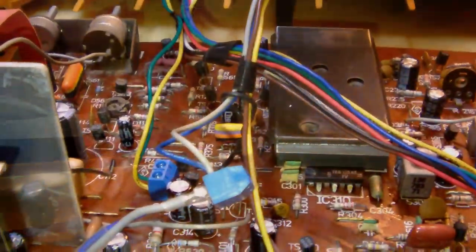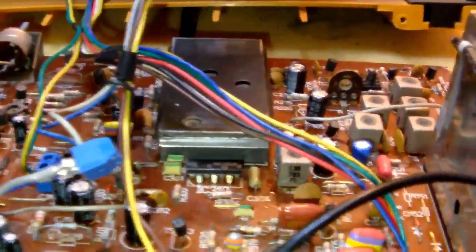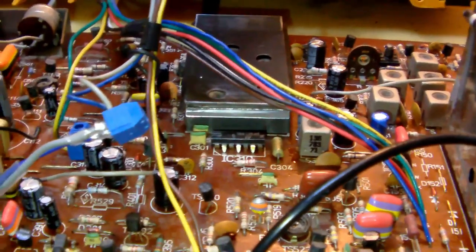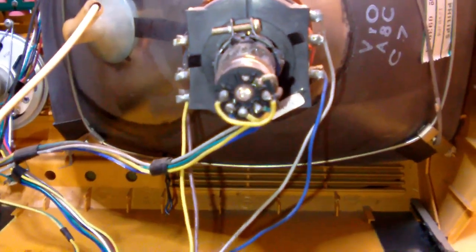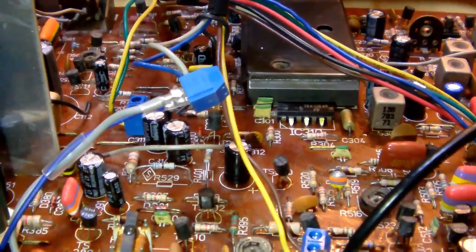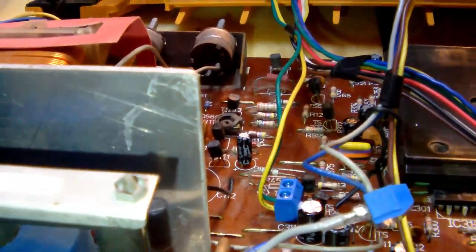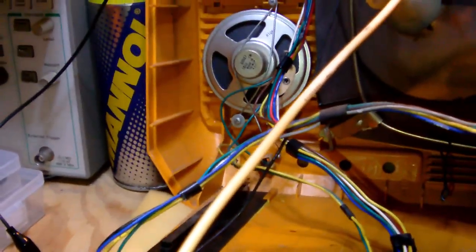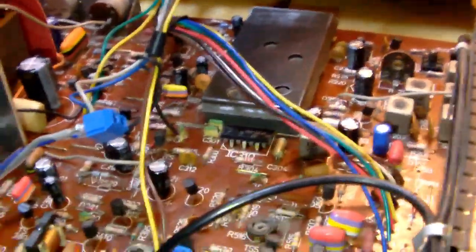All right, we know the TV wasn't getting any power. So the filament of the picture tube isn't lighting up. I hear nothing in the electronics that would tell me that, for example, the vertical oscillator for the picture deflection is working. There's no sound coming from the speaker. So, where would you start with this?